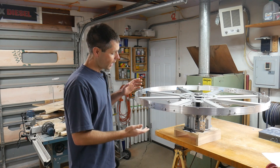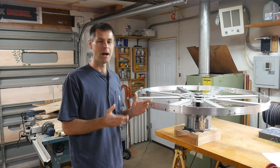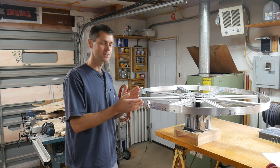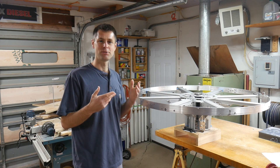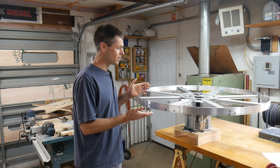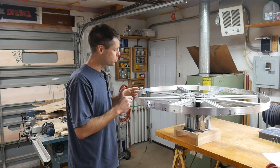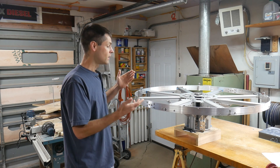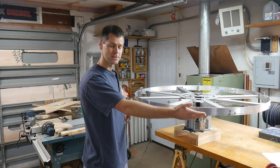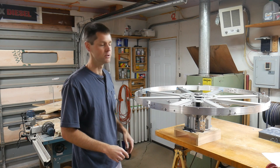The first thing that makes it difficult is simply the geometry of the table. I'm optimizing heavily for thickness because it adds to the utility, and I think it also really adds to the wow factor. A normal table is 5 inches thick, and so if you see this one, which is also 5 inches thick when it's closed, and suddenly it can rotate and expand and do all these other things, it's just amazing because it looks like a normal table. But doing that, of course, reduces the amount of space available to make all of these things happen. I pushed the mechanicals towards the center, which is helpful because you don't care as much about the height when it's in the center, but you then have a leverage problem. These ramps, for example, are roughly 10 inches diameter, and the table's 60 inches on the panels when it's in the large case, so you have leverage there. Any small deviations here in the height are multiplied as you get out towards the edge.